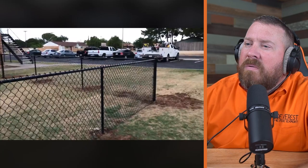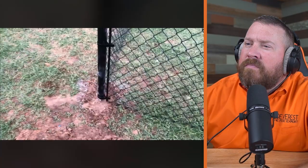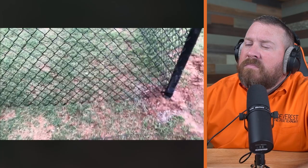But at this moment, the fence fabric is up, and now we're looking at the tension wire that goes along the bottom between the terminal posts, because that will help keep the fence fabric nice and tight and snug to all the terminal posts. So one tip is we typically put the bottom wire or the tension wire, whatever you like to call it, on prior to the fabric going on. That way it's sitting on the inside of the fabric ready to be secured. Putting it on after the fabric might make this a little bit more difficult.